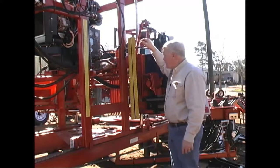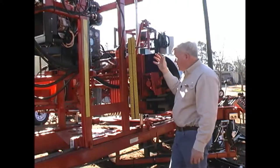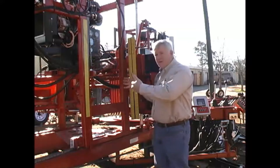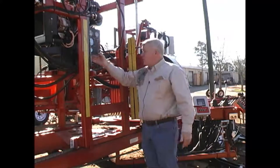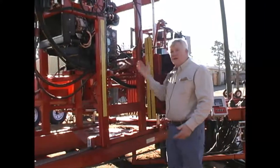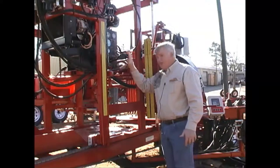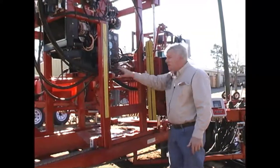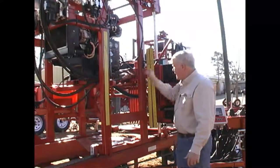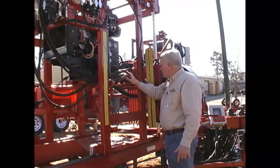The reason we do it this way: if we didn't have a way to tighten the belt on that side, you'd be trying to jack the motor over. We have the pump over here, and if you have to jack the motor then you've got to jack the pump too, which causes a lot more complications. I like the motor to sit right where it's at, bolted down solid. I do my belt tensioning with this idler and have an independent way to tighten the pump.